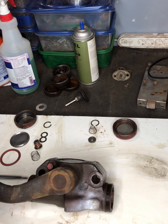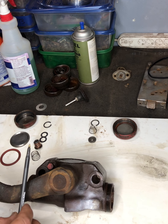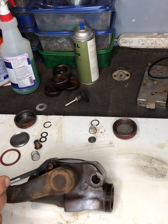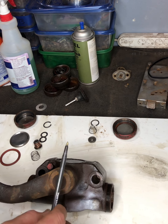The side that has this part that sticks out is your return side of the shock, and this is the compression side. The way this shock works is there's a piston, there's a cam where the pistons move back and forth controlled by this lever. The compression piston is slightly larger, the return piston is slightly smaller. Both pistons have a tiny hole that allows fluid to move between three compartments - outside the piston, between the pistons, and outside the other piston. These three compartments are almost completely full of fluid, with just a tiny bit of air regulated by the filler cap to allow for thermal expansion.